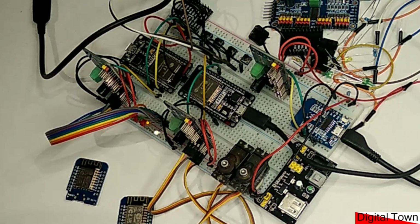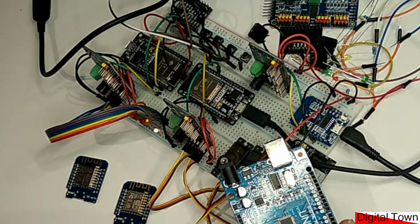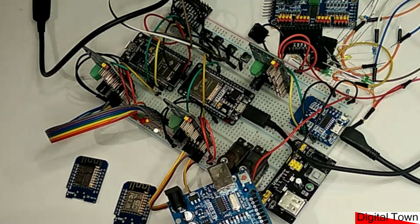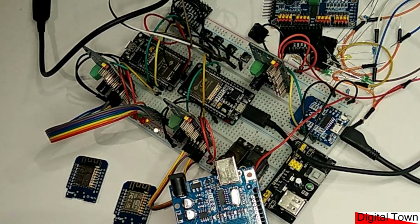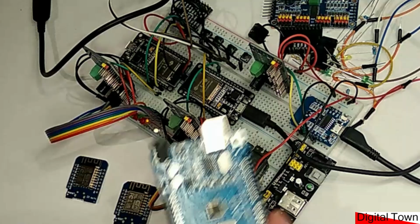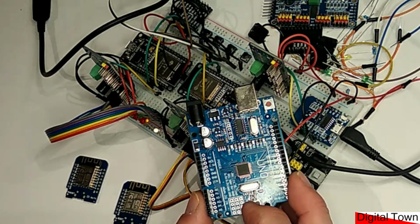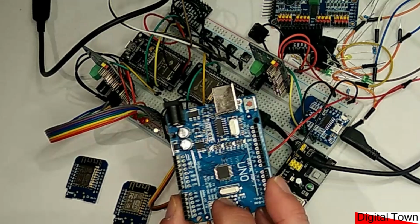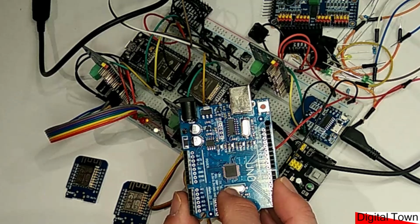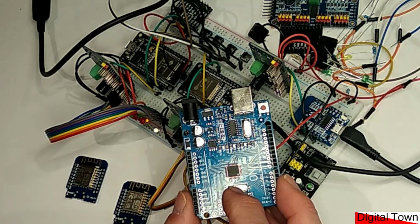So again, sometimes with testing, I've often done systems where I will take just a basic Arduino and program it up to feed a signal to something. When I built the bagging machine, it has a sensor on there that sends signals through at high frequency. Now, I couldn't bring the machine into my workshop to test it, so I just took an Arduino and emulated the signal, and I knew, if you like, the frequency of the signal that the machine would generate. So I ran my Arduino at about 4 times the rate, and the reason for that was to make sure that my code could handle all of these interrupts that were going on without breaking into a sweat or missing any steps. So when it comes to testing, the good old breadboard, that's what it's there for.